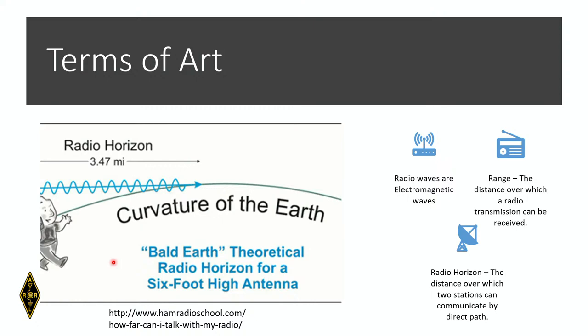And because of the curvature of the Earth, that distance, if you're about 6 feet tall, is about 3.5 miles. And so the radio horizon for a person on the ground is, at best, 3.5 miles. Well, let's say you've got somebody else over here on the other side, and they've got their 3.5 miles. So maximum line of sight on flat ground between two walkie-talkies, the maximum theoretical is probably 7 miles of range for both people to be able to talk to each other. But that doesn't then take into account buildings and obstructions and things like that. But I think this is kind of interesting.